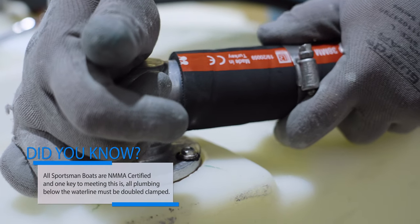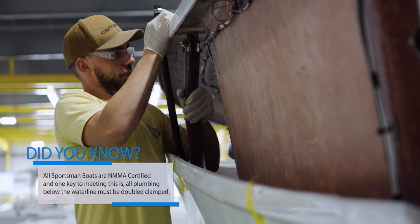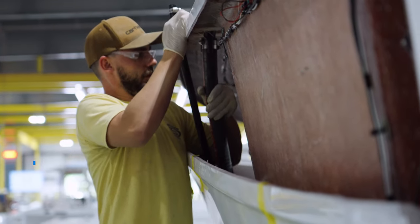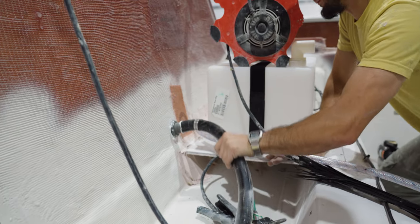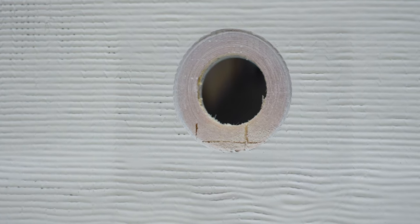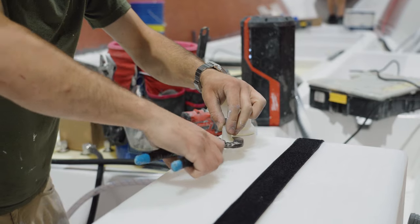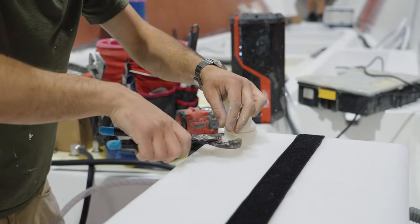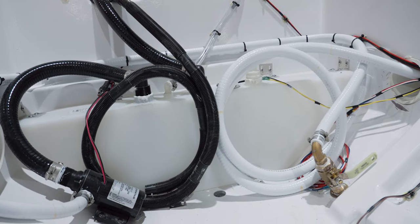Next, let's take a look at the wiring and other electrical components. Each Sportsman model has a wiring harness designed to accommodate all factory components available for that model. The harness is designed to be routed to each section of the hull. During this step, the team also installs important components such as bilge pumps, transducers, underwater lights, trim tabs, and any other build-specific components. Every wire will be neatly secured and routed through the stringer — this extra step will ensure years of failure-free use and avoid unnecessary nuisance sounds.